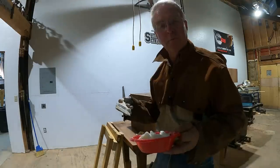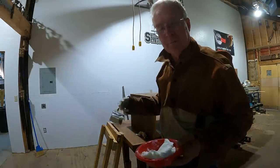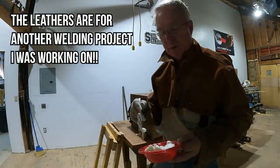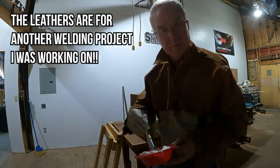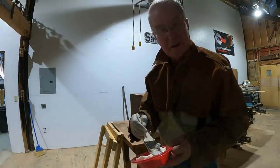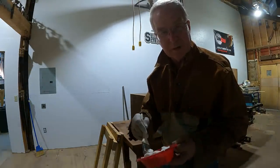Crisco — pretty good form release. Fill spaces, fill screw heads. I could just spray oil on this, but I'm going to brush the whole thing down with Crisco. I want to make sure that when it's time to strip these forms they'll release cleanly and we don't get any more embedment of these little wooden pieces than we absolutely have to.